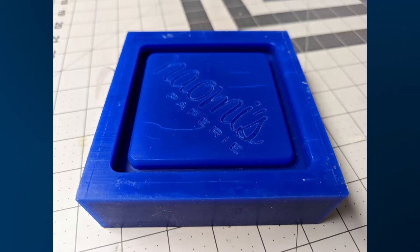This is another example of a great material to work with: machinable wax. Basically, machinable wax is normal wax that's had some additives added to it to make it a little bit more rigid and tolerant of higher temperatures, because when the machine cutter is spinning and moving through the material, it tends to build up heat. Also made on a milling machine — the same machine as the other parts you saw. And also a great material to just work with in general. If you want to carve something and need a big block of it, machinable wax is not a bad choice.